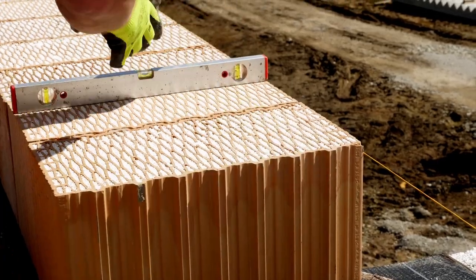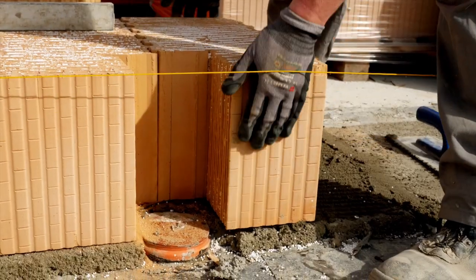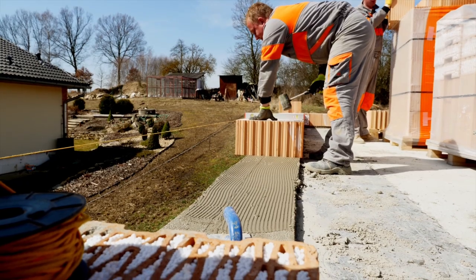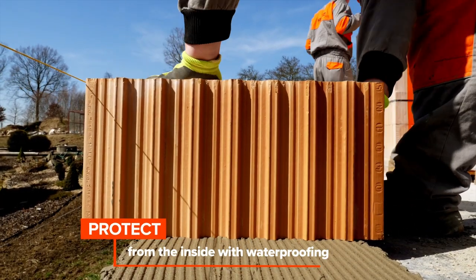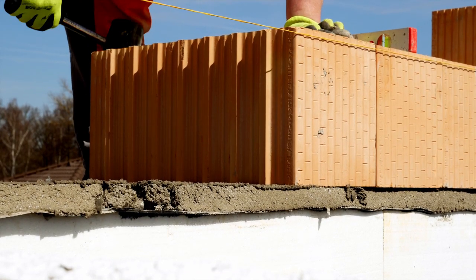The masonry footer on the slab base or sealing slab should be protected from the inside against moisture up to a height of approximately 10 centimeters by painting the bricks with liquid waterproofing, or by making a reverse joint of the coating waterproofing with asphalt strips or PVC membrane. Puddles of water are swept from the slab base with a broom.